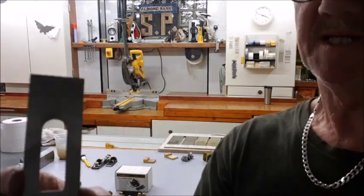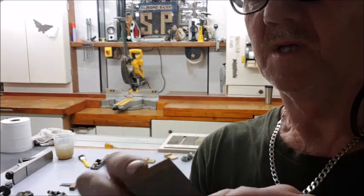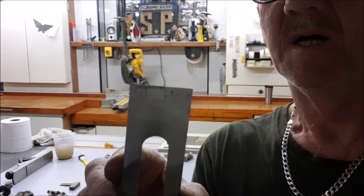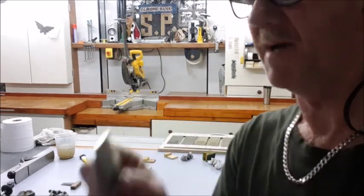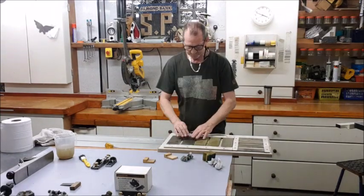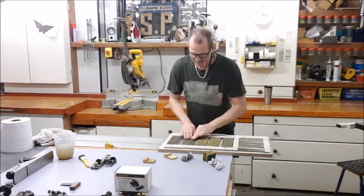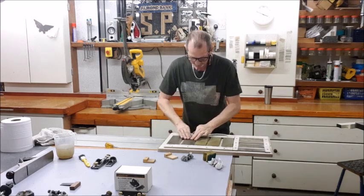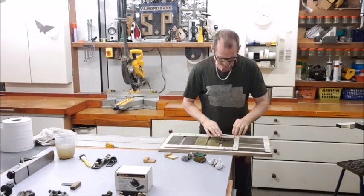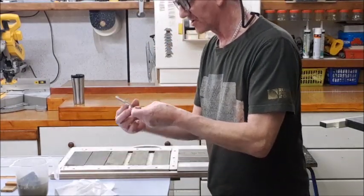This is terrible — I've found a blade here just to show you exactly how we do this. It's got dirt marks on it, like rust, as if it's been out in bad weather. It needs to go — we can't have that, we need it to be shiny. Also this blade has been honed on a wheel so it needs taking right back. I'm going coarse on the back straight away because I'm grinding this completely to get rid of all that. I think that is now about as good as we're going to get it — the blemishes are all gone.